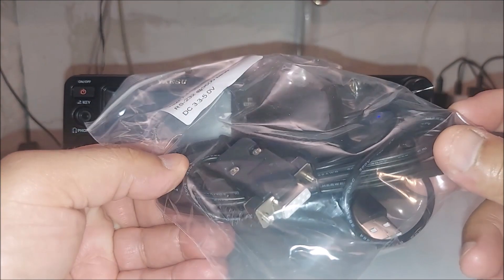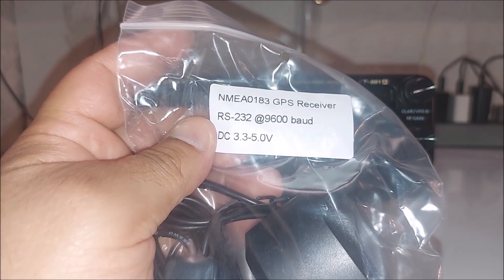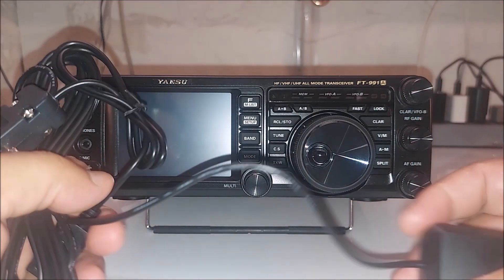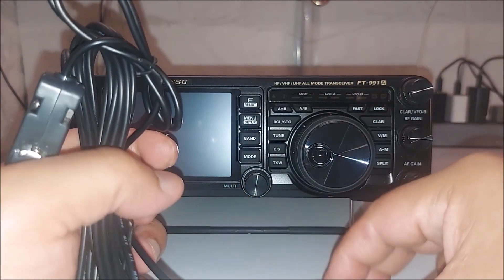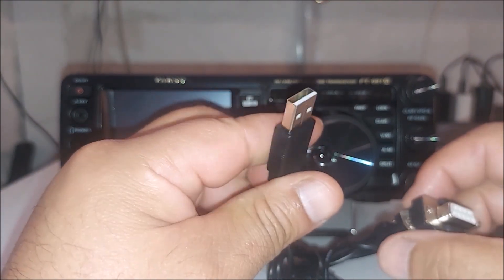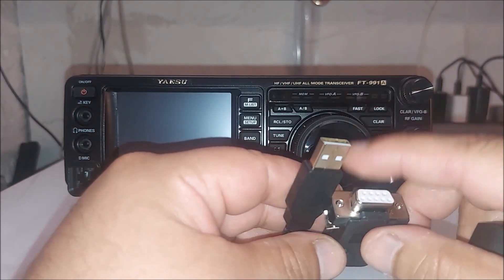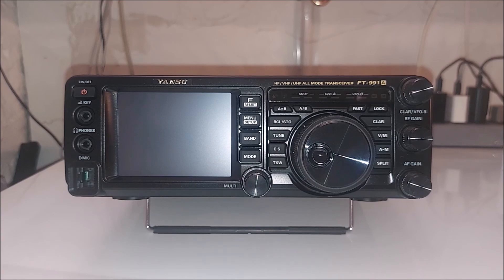Of course, like I mentioned, I did get the GPS antenna. It's RS-232 at 9600 baud, 3.3 to 5 volts — I will put the link in the description. So this is the GPS antenna; this is the antenna itself — it has a sticker, a 3M-type sticker on there, it's not a magnetic mount. This goes to an external power source like a USB wall wart, or I have a self-powered USB hub nearby I'll probably power it with. This way I don't have to put in coordinates — it'll automatically update.